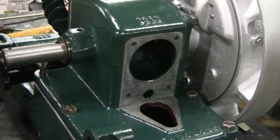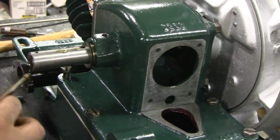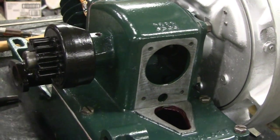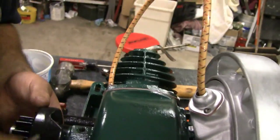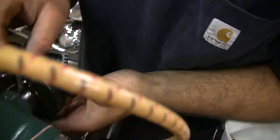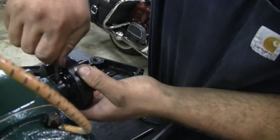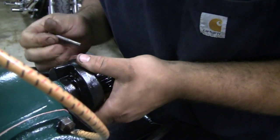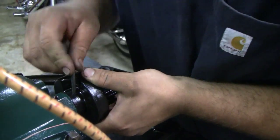We'll get a little bit of oil and slip it right on. Oh look at that — easy guys. We got our taper pin here that can only go in one way. That clutch actually has a weight on it to counterweight the piston right over here. The twin doesn't have that because you've got two pistons.